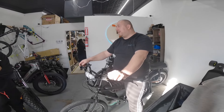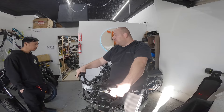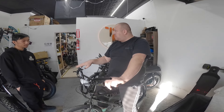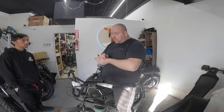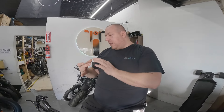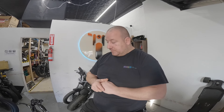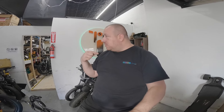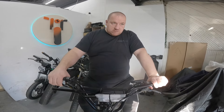The customer thinks you have three and a half hours to have this done. That's what customers always think. But this bike is not hard — the good thing is it's basically almost plug and play, motor-wise. Remove this one, slap on the new motor, put it back, and that's pretty much it. On the back we need to install a controller, and we need special mounting clamps for the controller. We know where to get them quickly. The TL3 Pro display has to go on the back or somewhere under the seat if it fits nicely.